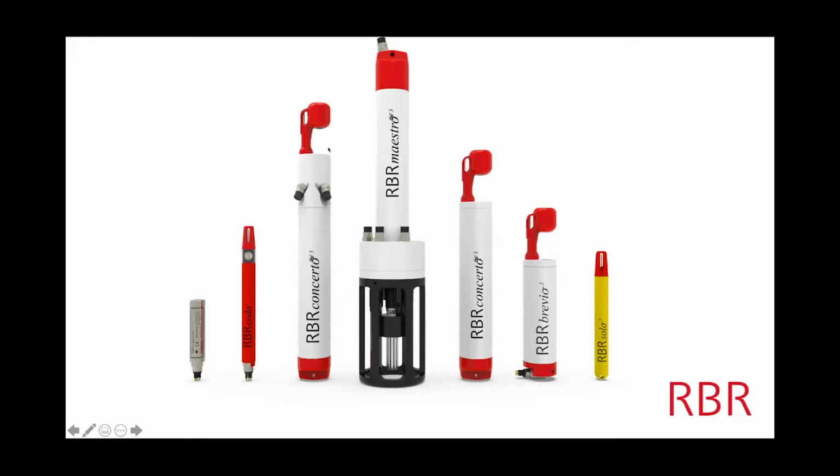So here, again, this would be a CTD, and we have a couple of external ports for additional sensors, like on the last slide with the dissolved oxygen. This is our Maestro, which can go up to 10 different sensors. So this one would have CTD, and then you could add on chlorophyll or turbidity or almost any different type of sensors. You can see we have some connectors here on the back to add cabled sensors. This one's probably the most familiar to folks who use RBR for profiling and open ocean work. It's a CTD, so it's similar to this one over here, except this one just doesn't have the two connectors.